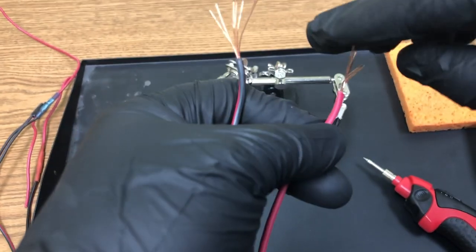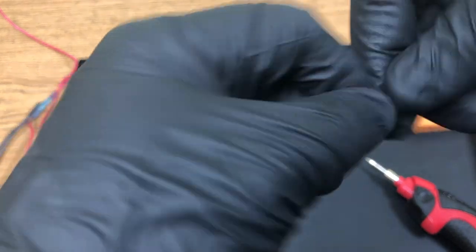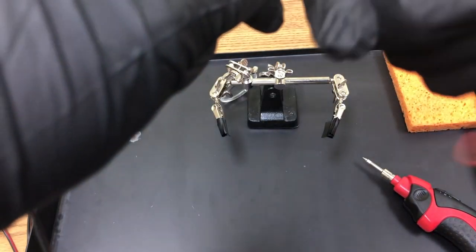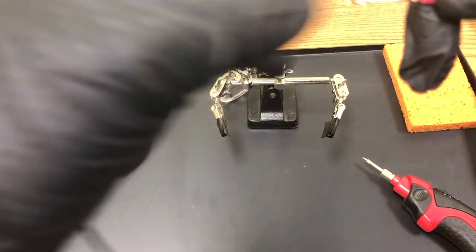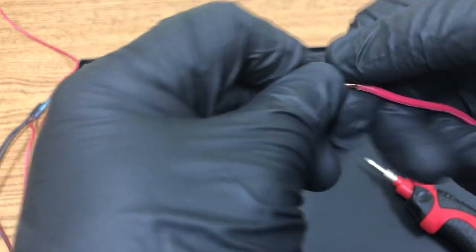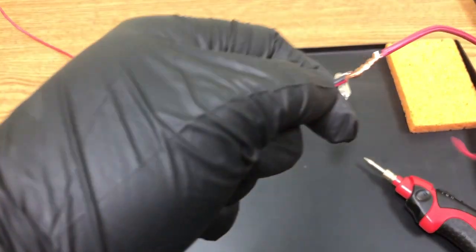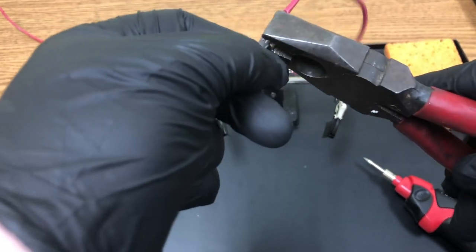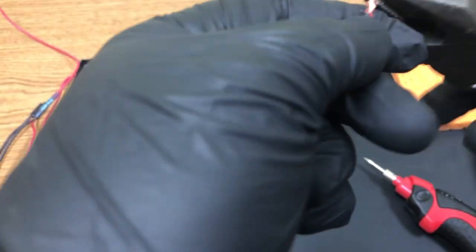There are two ways to join the wires. One is fanning — fan out the strands and twist over itself. The other I call the X method: hold both wires at a midpoint like an X, fold over, and twist. Sometimes the X method ends don't look as clean, so use needle-nose pliers to flatten down any strands sticking up — you don't want those poking through.